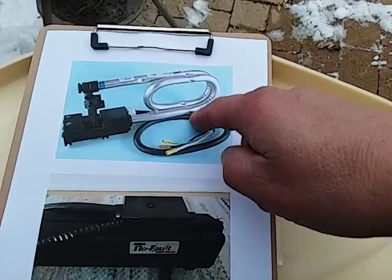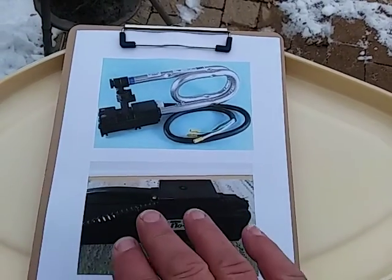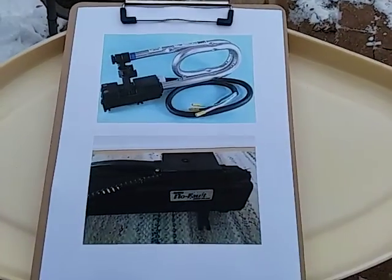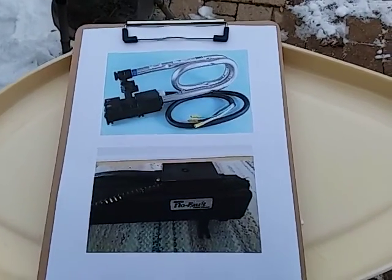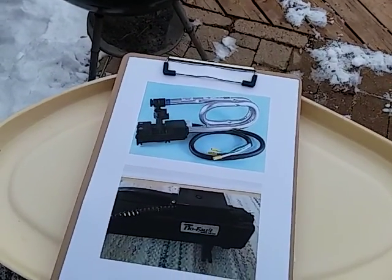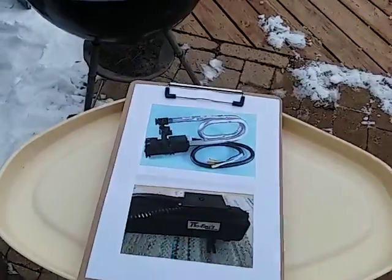This other heater style had a reset button on the back side — again, take a ballpoint pen and poke at the little rubber circle to hit the reset button. They stopped making one of these heaters 18 years ago and the other 17 years ago. If you have a heater that looks like any of these, it's most likely two decades old — closing in on 20 years. It's time to get a new one. I see very few of these in the field anymore. As long as you have good input power, a good relay board, and you're hitting the reset button, you could probably just have a bad heater — and it wouldn't hurt to replace these anyway, being that they're so old.